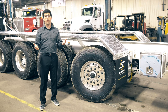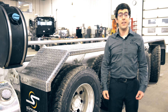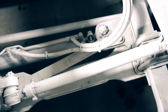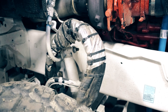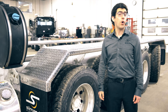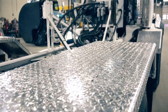This offers the best compromise between maneuverability at low speed and stability at high speed. The ETS system has been designed to include a self-diagnosis mode as well as fail-safe components, meaning that if the ETS detects a problem with one of the key components of the truck, it will transfer itself to a self-steer axle for better driver control. For this unit, we were also tasked to design custom-made fenders to cover all three drive axles as well as the ETS.